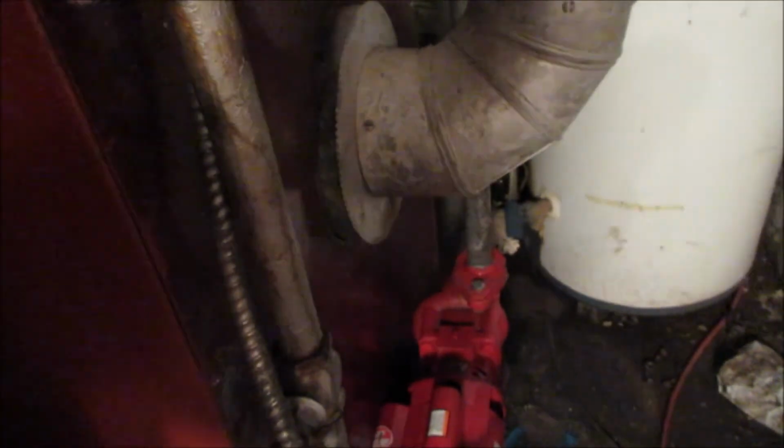But when I was hitting the valve trying to break it loose, I loosened up that aquastat, so it's a little bit off. So now I gotta let the pressure in the boiler along with the heat temperature figure out if it's gonna be able to shut off with the aquastat or if I gotta lower the aquastat down. It goes up to 220 degrees, but it's gonna put over 30 pounds of pressure and probably blow the system. So jack of all trades, master of none.